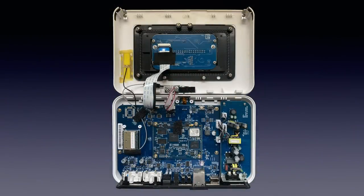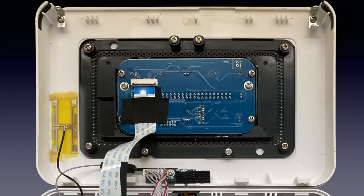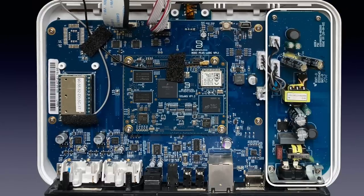The Node opens up into a top and bottom half. The top half has two antennas — one probably for both WiFi and Bluetooth, while the second is probably only for Bluetooth. This is because the Node can simultaneously receive music over Bluetooth from, for instance, your smartphone, and send music over Bluetooth to a set of headphones or Bluetooth speakers. Below the glass touch surface, this board interfaces the sensors. The bottom holds the most circuit boards. On the right, a switch-mode power supply that is completely separate from the rest. It's not strange that there are third parties offering retrofit linear power supplies.